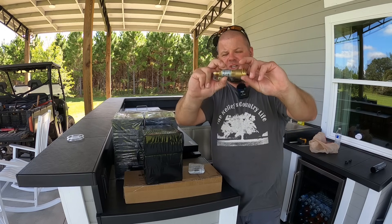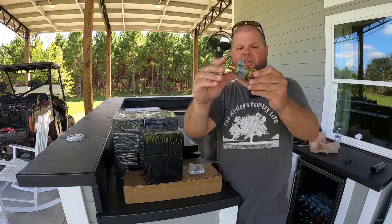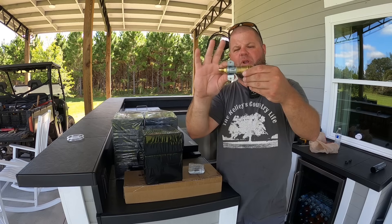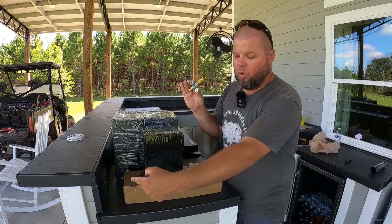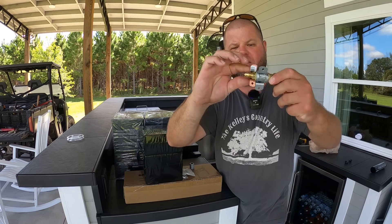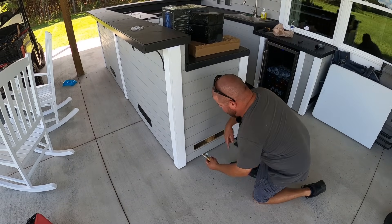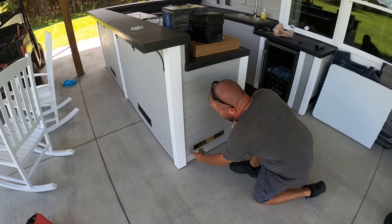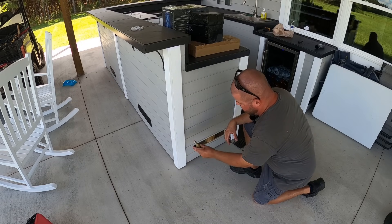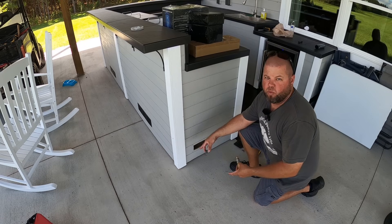Because I'm connecting to this on the outside, it's going to want to twist. I don't want the hose inside to come unscrewed. I've got a half-inch conduit clamp that fits perfectly over this — it'll cinch tight, and there's a piece of metal I'll stab into the wood, then cinch it down with good screws against the four-by-four post in the wall to keep it from spinning. A good spot to install this is near the vent where I already have access. I want to keep it low because a fish cooker hose isn't very long and is designed to go down low to a 20-pound bottle anyway.